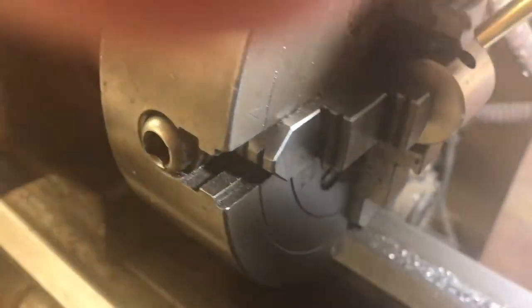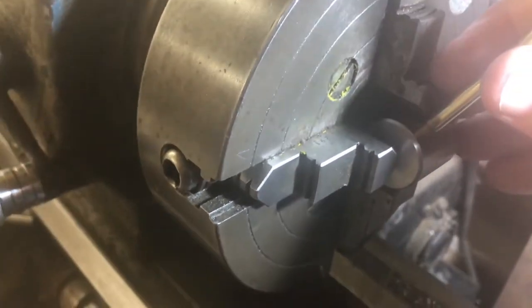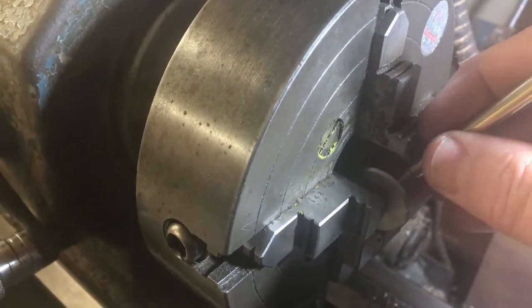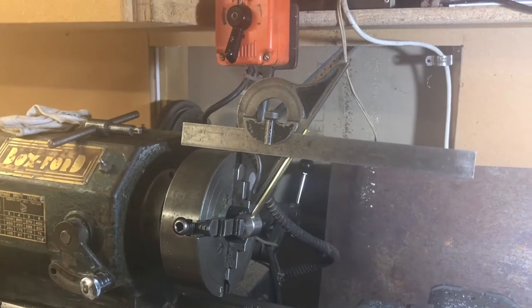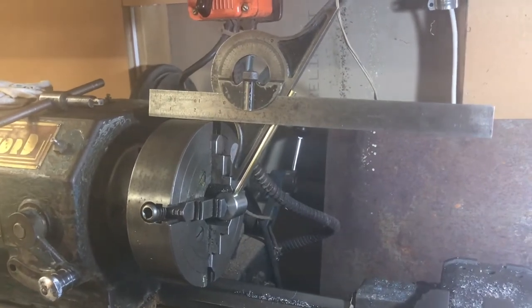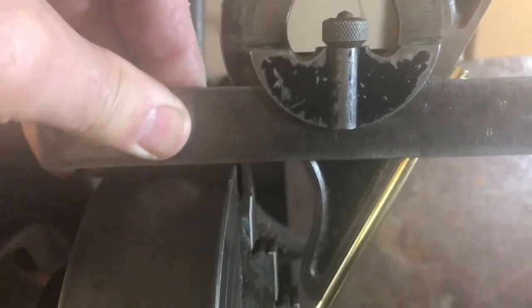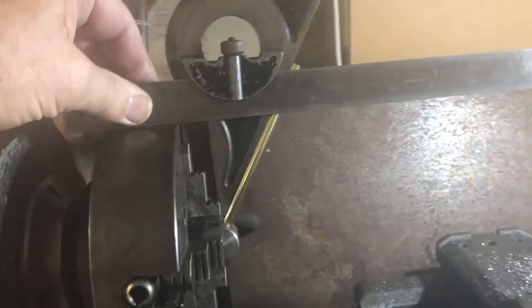Instead I've adjusted it to 60 degrees and we'll drill the hole right through — the hole on the other side will be 120 degrees, while the one on this side is only 60 degrees. I've put a rod in the hole so I can check the angle of the first hole. Now I'll be drilling the second hole straight through, using a protractor set at 60 degrees to get the angle of this rod correct. And here we can see it is correct at 60 degrees.